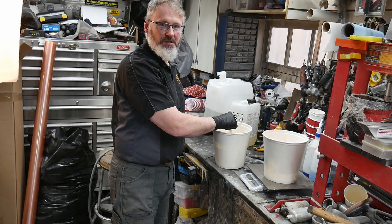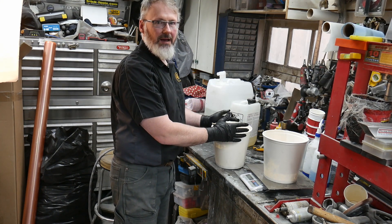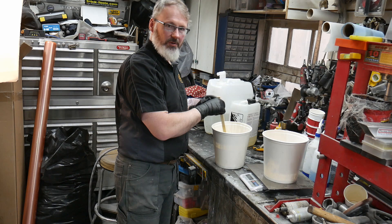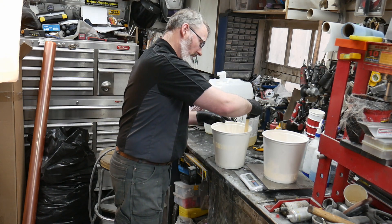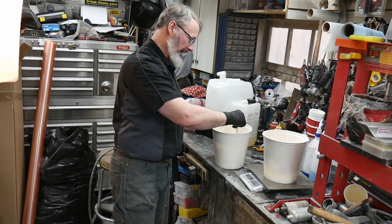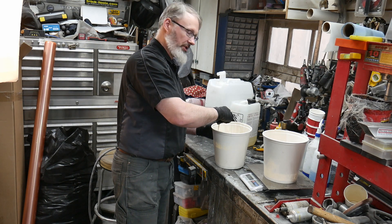It's important that you spend a lot of time mixing. In the pot, if I kept it all in one bin, I still have about six hours of working time before it starts to go off. I'm using a bamboo stir stick and I can scrape the edges — I can go into the bucket and scrape down the edges really well to make sure that all of those epoxy resin molecules are catalyzed by the hardener. Making sure I get it all stirred in.